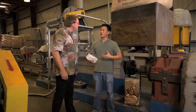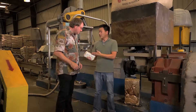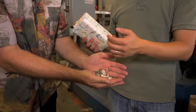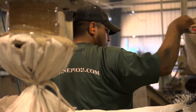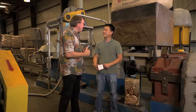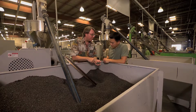Jonathan Lee explains the next step: blocks of recycled polystyrene from MRFs and other suppliers are broken down into smaller fragments. They go into the pellet machine, which stretches the material into spaghetti-like strands and cuts them down further into pellets. Those pellets are then extruded into picture frame moldings — the pellets are the feedstock to produce the frames. These are the pellets we just saw being made at the pelletizer, and this material is what the frames are made out of.